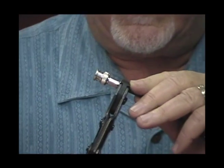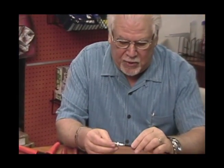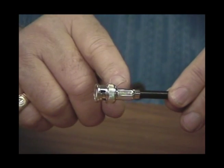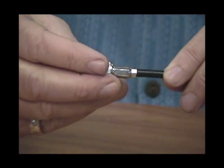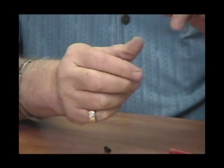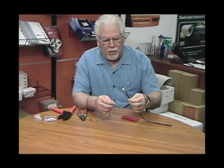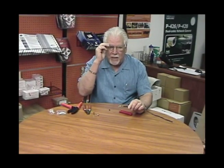This is a ratchet-type crimp tool, so apply enough pressure to form the octagon shape. The final step is to crimp the back of the ferrule using the ending jaws — crimp that one time. Now you have a perfectly installed crimp connector with an octagon crimp right after the connector and a crimped back end, giving you a double seal. This is the proper way a connector should look once installed. Thank you for joining us today.